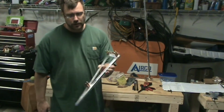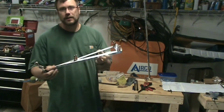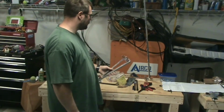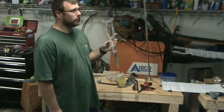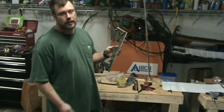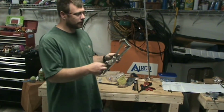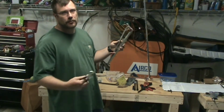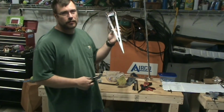Basically, you go through, make them all look like this, A through G, and they'll be match drilling, but I'm probably going to assemble them all first and then match drill at one time, even though it says assemble, match drill, and then after that the instructions are repeat through all the stiffeners.